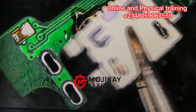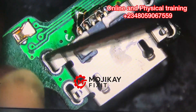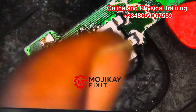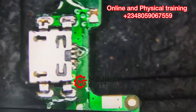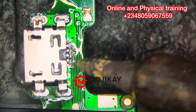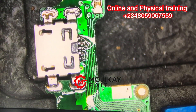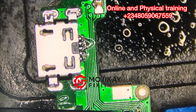Now I'm coming with my charging port and laying it gently right on the spot. I'm applying flux — I want to advise you as a technician to use good quality flux while working; it makes your job clean and very easy. I'm repositioning the charging port so that it will enable me to solder properly. I'm applying solder paste at 183 degrees Celsius, then soldering the pins to the scratched parts I've prepared. After that, clean — it is important that you clean your job and make sure they are properly secured.